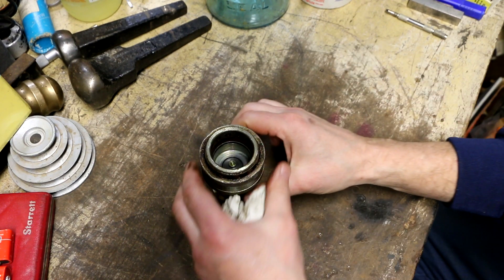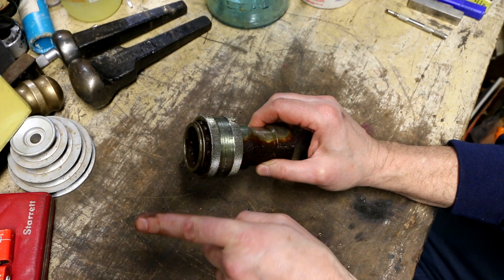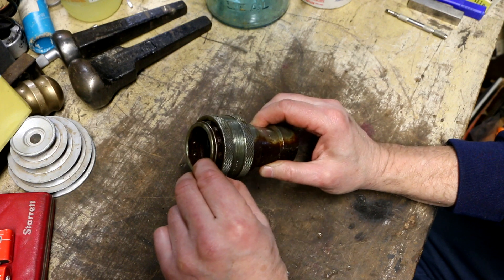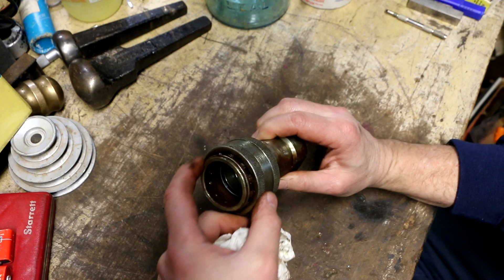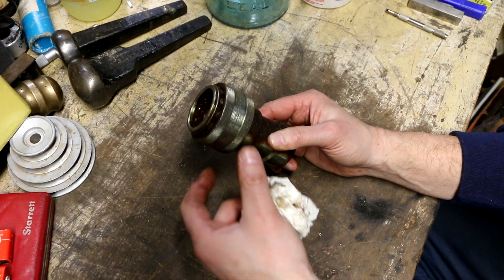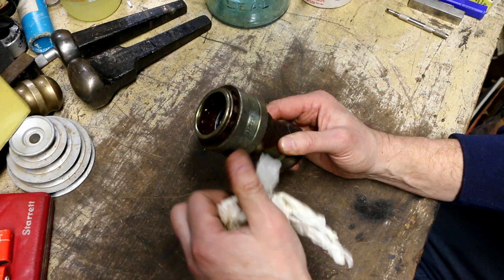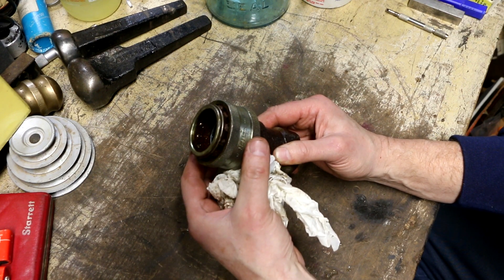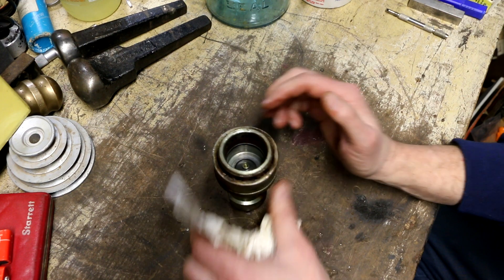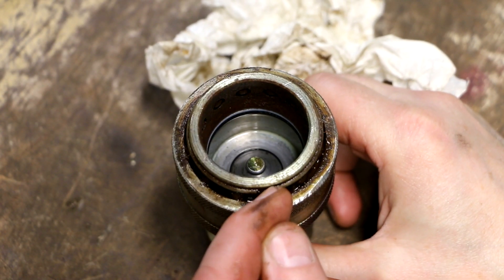To get it apart, this ring — which normally snaps back from spring pressure — is now stuck back like this. You pull back on the ring, and there's a wire snap ring right here. You remove that wire snap ring and that allows this to come all the way off. Normally you have to hold it back to get the snap ring off and then carefully allow it from spring pressure to work its way over. In this case it's stuck back there, so I don't have to worry about it snapping back yet. You can see this end of the snap ring right there.